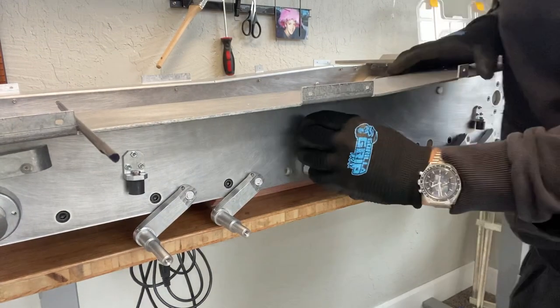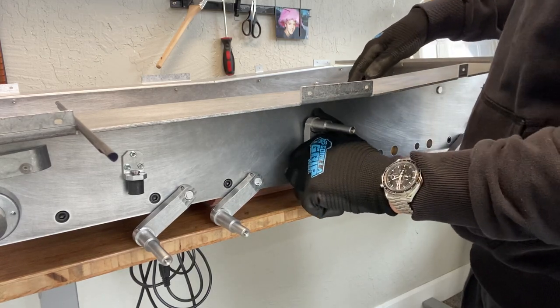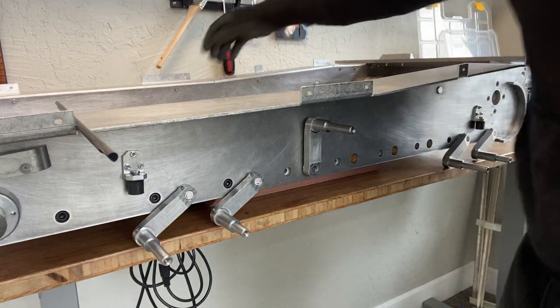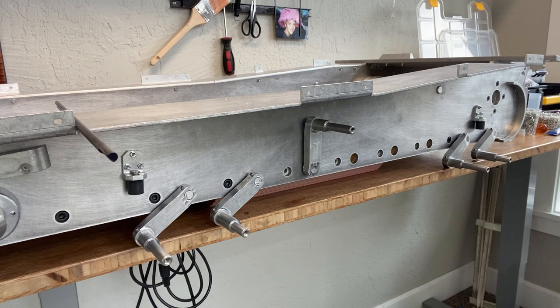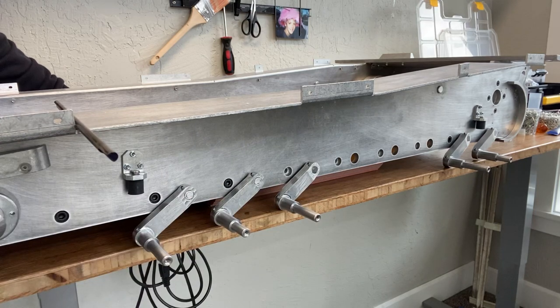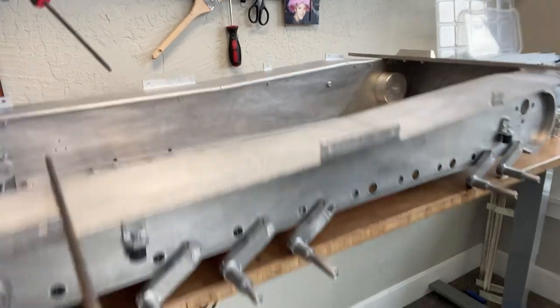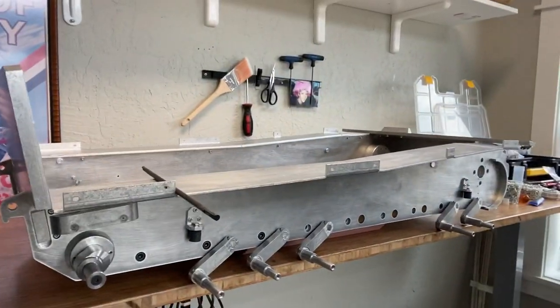So I've got it at the right distance and it's attached and fixed to the torsion bar. I'm going to reach over and loosen the fixed end with the large bolt and just let it flop down. I know it's at the right angle because the hull should be relatively level. I'm going to tighten this other fixed end with my 5 millimeter driver. The grub screws are now facing down so I couldn't tighten or loosen them either way, and that looks pretty good.